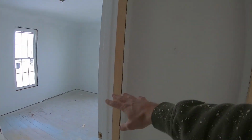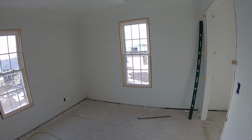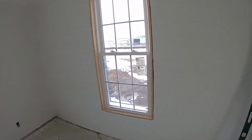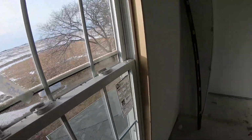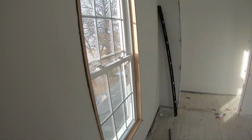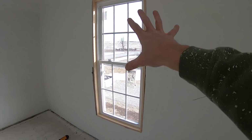Different widths, 1.5 inches, 3/4 inches, like 3 inches. They're all over the place, they're a mess. But anyway, they're done. I'm glad to have that behind me. So now I've been working on jamming out these windows, using the same basic technique that I use for the doors. I'm using pocket screws to build the frames, and then I can just pop that frame into the opening.